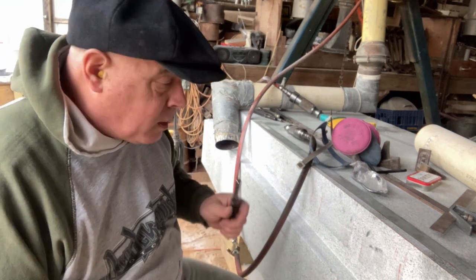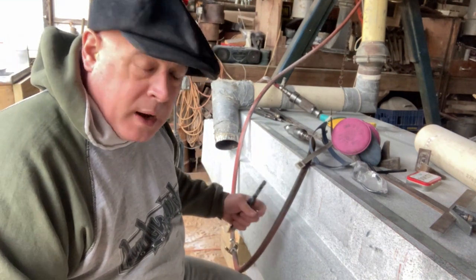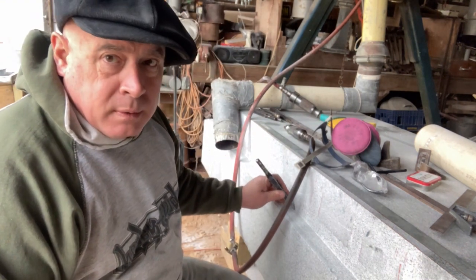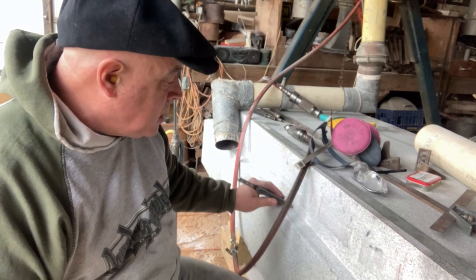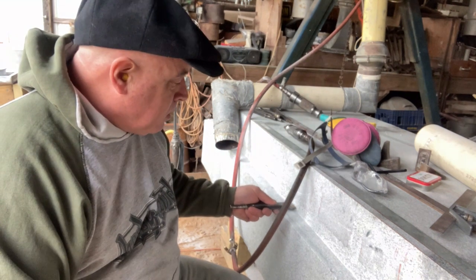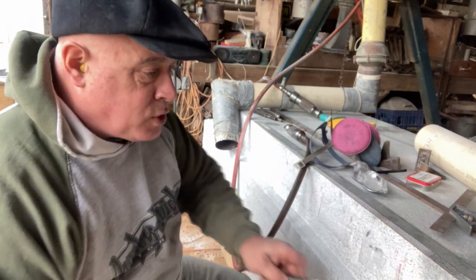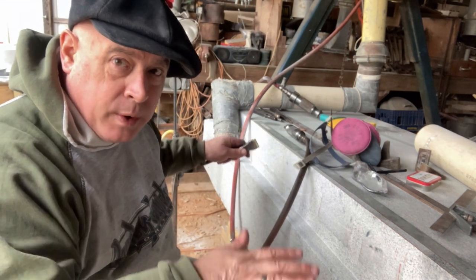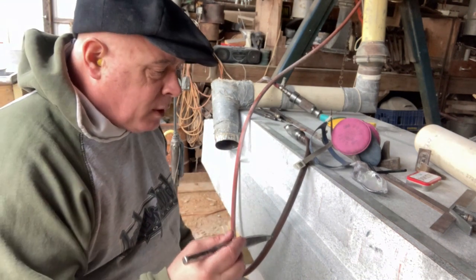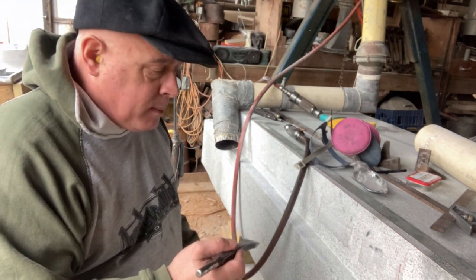Just like when I talk, because we're going to stun a line like that in order to make this break when we chip it, so we get a good break. The problem is if you cut that line in before you've got it in the right place, you could end up having a big stun that's 1/8 of an inch or 1/16 of an inch or whatever from where it needs to be, and you're not going to be able to clean it up without pushing this entire line back or down to a different position. So that's part of learning how to use your tools towards your benefit versus creating another problem.